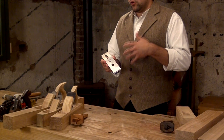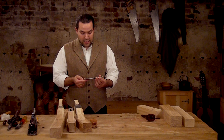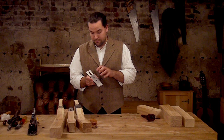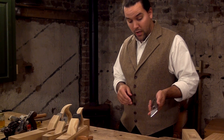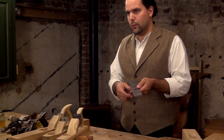I just wanted to make something that is followable for most folk. If you're going to use an iron like this, you'll be able to build along using my measurements. But if not, you'll just have to accommodate the measurements of your iron to suit the plane you're making. Now, this is actually the first time I've ever bought an aftermarket iron — except for my big number eight jointer plane where I burnt through the first one already. I've been very impressed with it, but it's a separate video in itself. By the way, this iron is out of the bench plane range that is for the Stanley planes — so this is not the wooden plane iron. They're made for the Krenov-type planes and they're a bit short for what we're doing, so if you're going to go down that route, get the full-length bench plane iron.